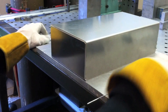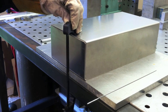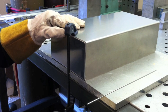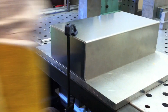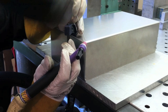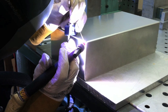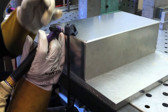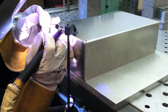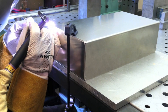You need several tacks when doing a job like this — tack every few inches, and the thinner the metal, the more tacks you need. This is 11 gauge, so a tack every three inches or so can be enough. Too many tacks can mess with the overall appearance of the bead when you're finished. You want to make your tack welds a little bit smaller than your final bead so you can completely consume the tack and not be able to tell where it was once you're finished.